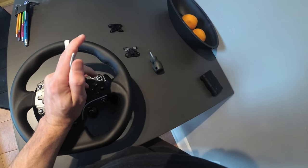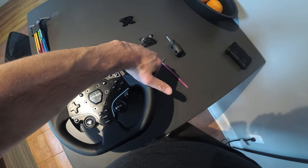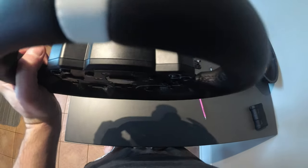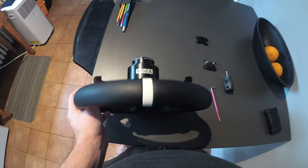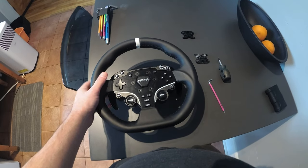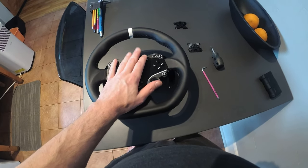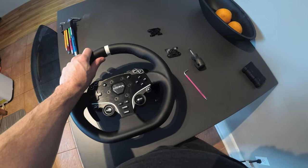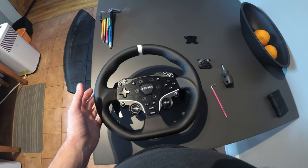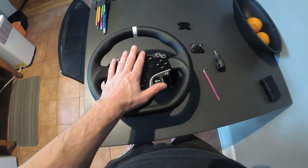Tighten these down, put this back in. Once you tighten this back part down, put this back piece on, connect the little connector, and then gently flip it over and put your steering wheel cover back on. Make sure all your buttons feel okay before you do the final tightening down. I would suggest not tightening too tight depending on how good your print is — it will affect how well the clickers work in your paddles. You can see now — all good. That one sounds a little bit different, but I think there's some permanent damage from where it was broken for so long. Everything's all lined up much better now. Hopefully they'll last for quite a while. Make sure to go with ABS or get them printed in aluminum. That's the end of the tutorial on how to fix these steering wheels — fairly similar for the R3, R5, and R9, just a little bit different equipment inside, same print file.